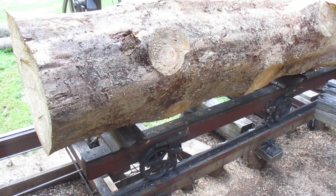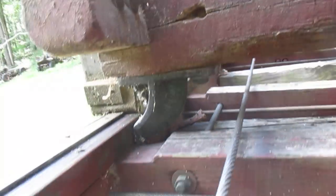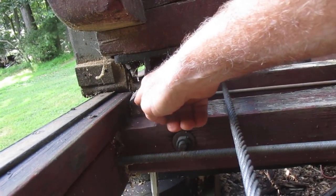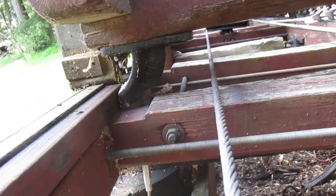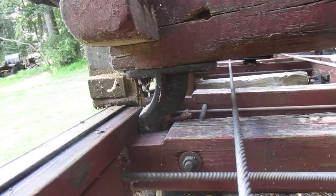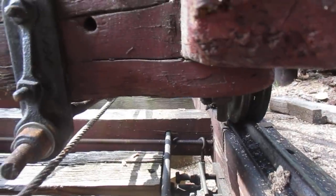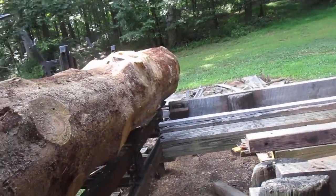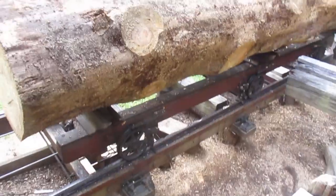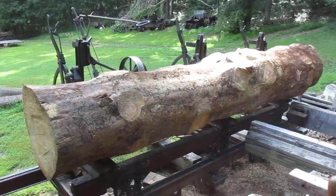Frick has anti-knock-off castings that go on the back of these, but they don't really work all that well, so I find it better to strap them down. I have those castings on back there - I didn't even remember putting them on. There's three of them because you've got three axles, I think that's how they do it. See that thing right there? It's supposed to keep you from knocking that carriage off. I think it might help, but I've knocked the carriage off a couple times. What they did to prevent that after they started putting hydraulic log turners on there is they put the hump track in the back so it almost acts like a fulcrum. As soon as you have it come off this hump track in the front, which only has to come up like 9/16ths of an inch, then it's just flat metal-on-metal heading off the track. Everybody dumps the carriage from time to time - it's not good, but it happens.